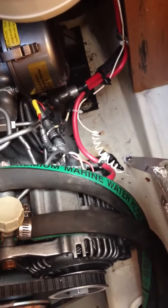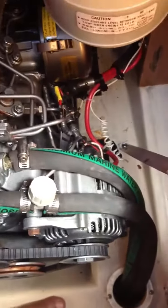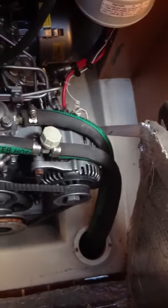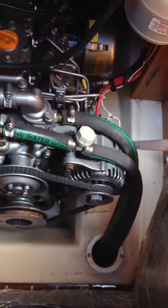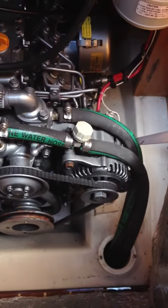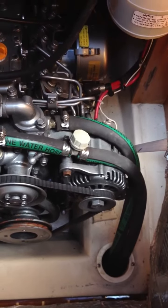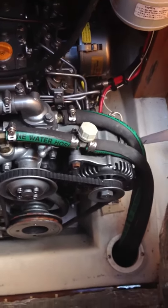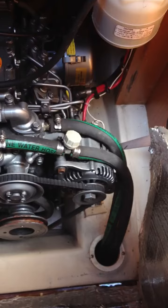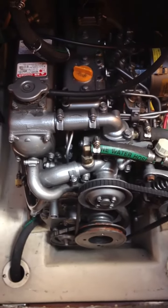I'm going to draw my electrical circuit because I'm replacing the batteries as well. The thing with this boat is that it has the isolation switch for the batteries. There are two switches — both are just on/off switches. It's not the typical isolation switch for batteries that shows battery one, battery two, both, and off. I find when I turn off my starting battery, my tachometer goes off. I just wanted to be sure that my house batteries would be charged directly when that was off, if the motor was on. So let me go and review this, and I'll get back to you.